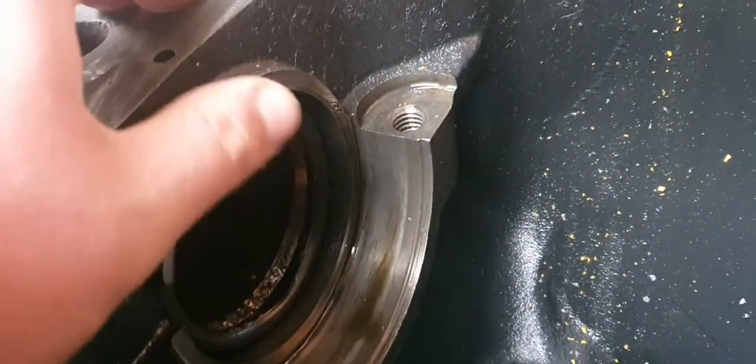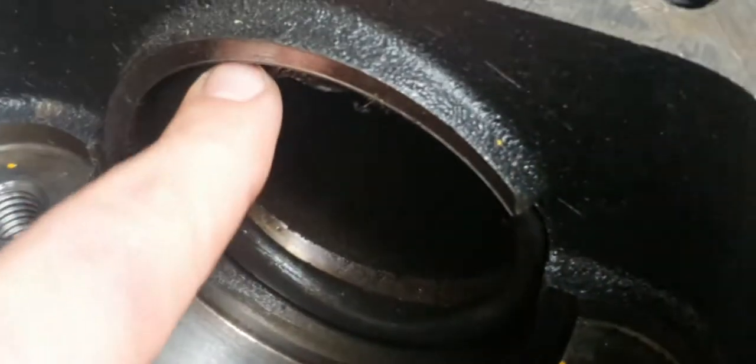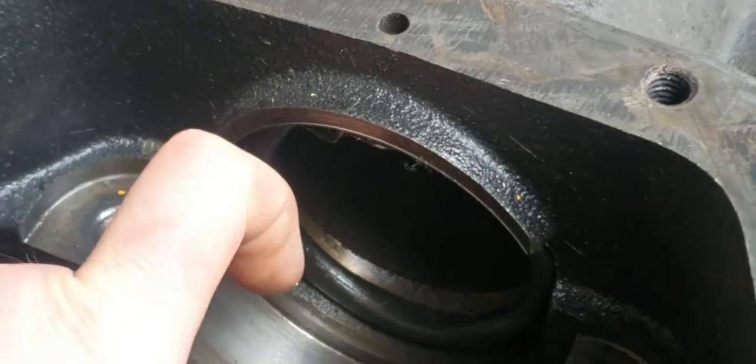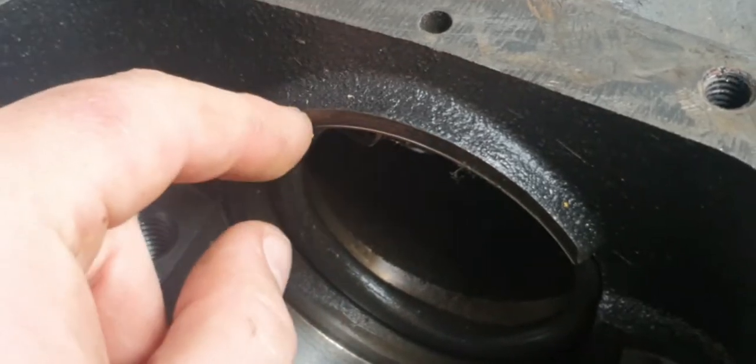You made up some tools, spot facing tools, for F350s, F250s, Land Rover Dana 60s, they suffer. That worked out right at that end. So I'll go and get these parts that I used in the past. So the bearings skid around and they wear into this shoulder here and throw up a burr. And that could be all out of square. So we get a tool that bolts on the end there and comes through a bar with a high speed steel tip or whatever. You rotate it with an electric drill at that end, and it comes around and just cleans up that face. Do that to both sides and it fixes that problem.